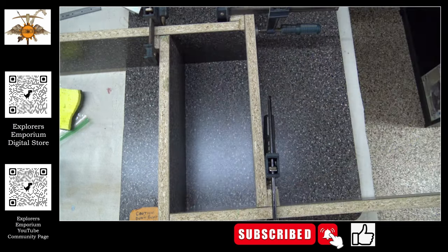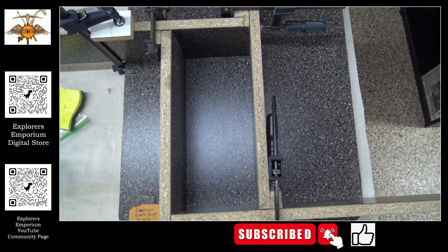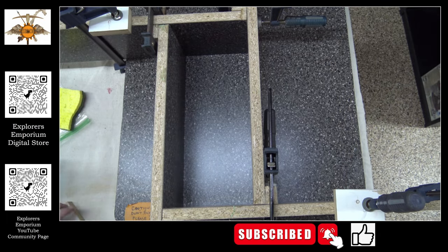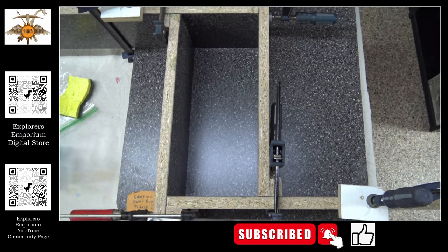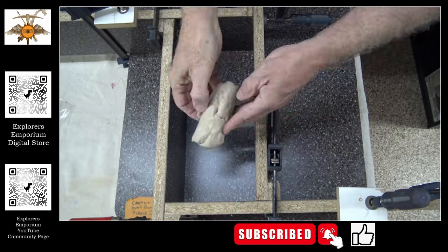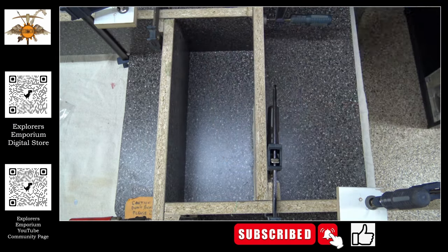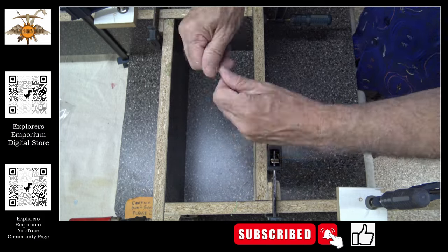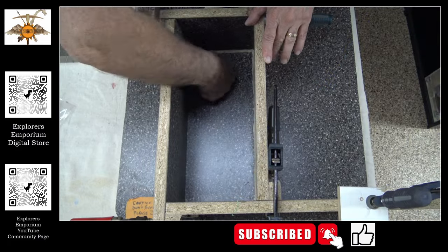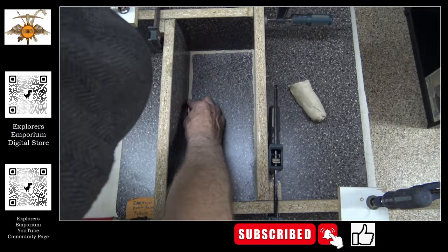Right now we are getting the actual mold all set up — framed out and measured. Now we have to put clamps to mount it down onto the board so that it doesn't shift around while we're making our casting. We're going to put clamps down on each of the beams, pinching it in place. It's important to take your time. Using the clay, we are going to fill in any place where there might be gaps, because whenever you get a leak at the bottom it's a bummer — you have to use more silicone.